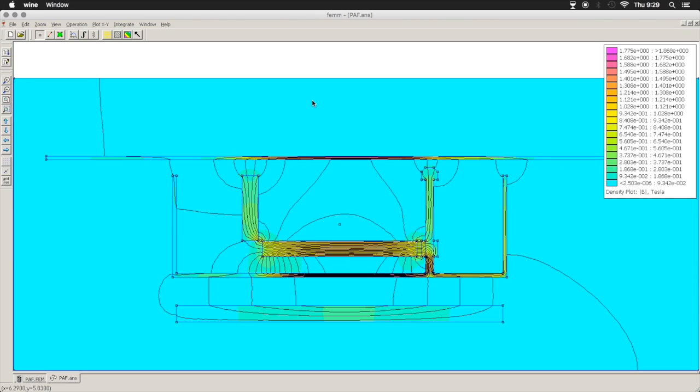Now, what this doesn't show is what these effects do in the electrical world. So if you are adding this cover on top, you're going to change both the inductance of the pickup and the capacitance, like we mentioned before. Also, you're going to change the inductance heavily if you add a large plate on the bottom, the capacitance to a lesser degree because we're further from the coils. But again, we're just looking at magnetic fields here in a very general two-dimensional way, and hopefully that gives you an idea.